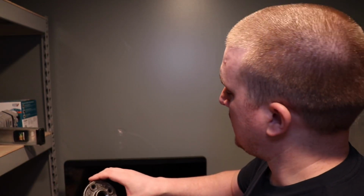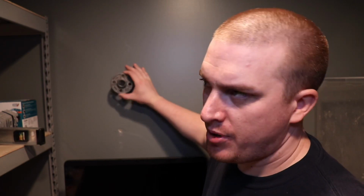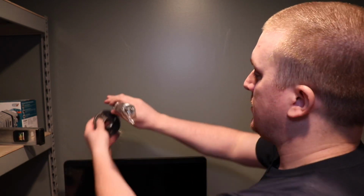Somebody's probably gonna tell me in the comments what they're really used for. It's one of those Pinterest things probably, but there's a base plate. This base plate is actually gonna be attached to the wall, and I'm gonna be using drywall screws, as only the top and the bottom screws are actually gonna be able to fit on the stud. But then the other two screws on the sides will still offer support. A piece of pipe is gonna come out of that wall, and you're simply just gonna use some pipe clamps up underneath to attach the shelf to.